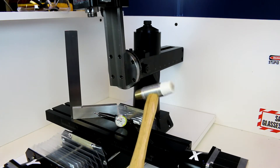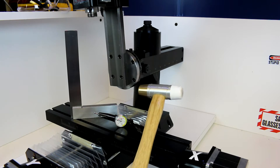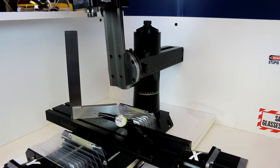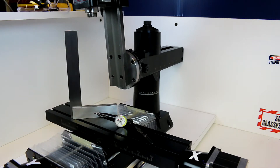Finally, having a small hammer — and make sure it's a soft-faced hammer — will allow you to nudge some of these alignments into place. If you don't have a soft-faced hammer, then use a block of wood or something along those lines to protect the finishes on your mill.